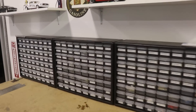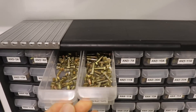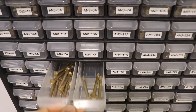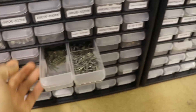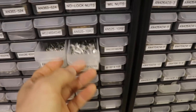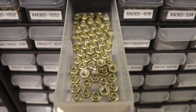If you're going to build an airplane, I can't even tell you how handy it is to have a large bench stock of nuts, bolts, fasteners, and nut plates. What I do every year when I go to Oshkosh is just stock up on hardware — I'm like a kid in a candy store. I've got rivets, cotter pins, countersunk screws, just a little bit of everything. What we're going to use here are the AN363-1032 nuts, which are the metal locking nuts that don't have nylon.